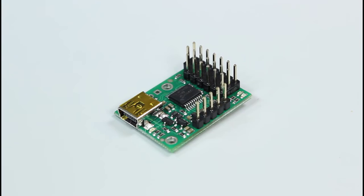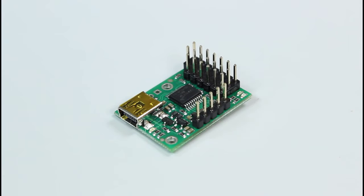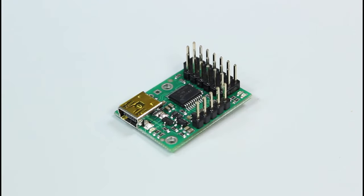You could also use some hot glue to make things a little more permanent. Rather than driving servo motors directly from the OpenMV, I found that this Micro Maestro board from Pololu is super helpful. It handles the servo pulses on up to six different channels and has built-in features like the ability to accelerate, decelerate, and limit the speed of a servo's movement. With a little tweaking, we can get the servos to be more lifelike without the fast jerking motion. All we need to do is send some serial commands to the Maestro board, give it a desired position for a servo, and it handles all that complex motion for us.